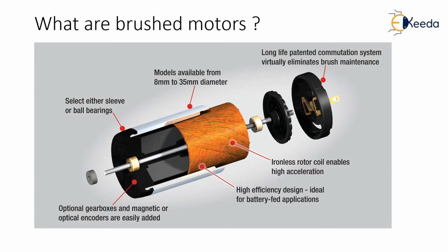The internal operation of a brushed motor is contrary to that of a brushless drone motor. In the brushed motor, the stator provides a permanent magnetic field that surrounds the rotor. The rotor of the brushed motor is an electromagnet which is influenced by the surrounding stator. A pair of brushes attached to DC power contact the commutator ring at the base of the rotor.